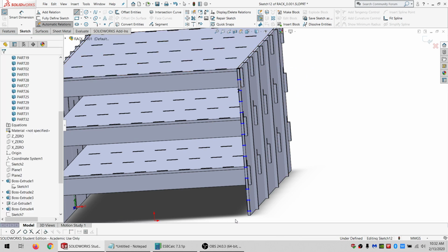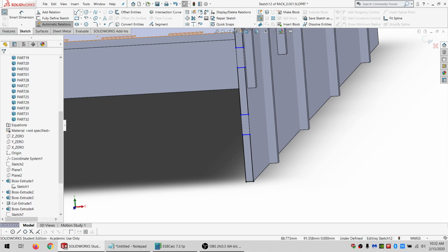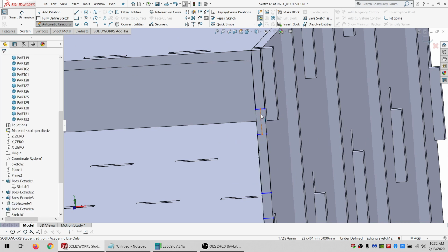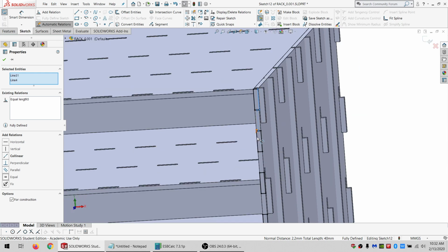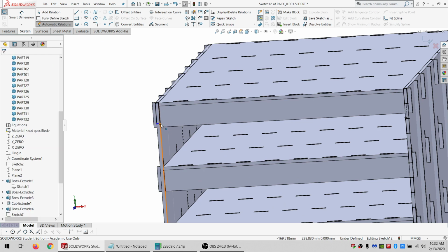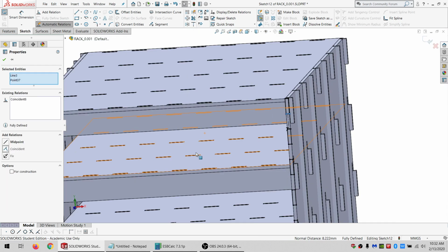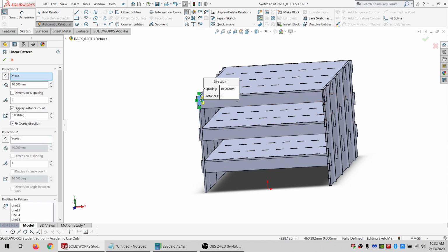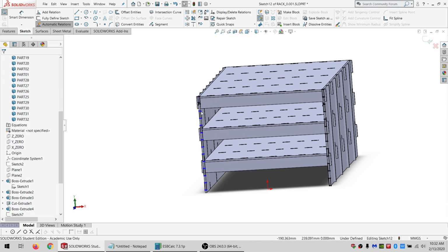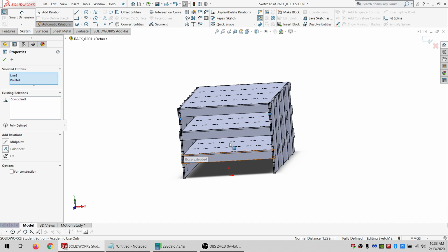So go there and coincident there. And then I just need one little construction line so I can use an equal constraint. That's all locked down. And I'm going to do basically the same thing over here. This time I can go ahead and lock this right away. Do a linear pattern going down of 7. And I can just lock the second one to the second one. And then it's fully defined.